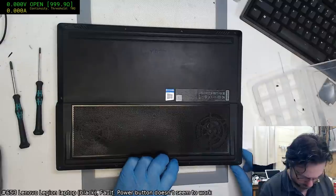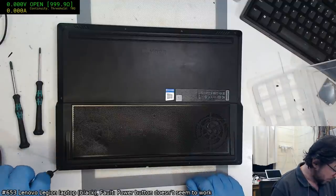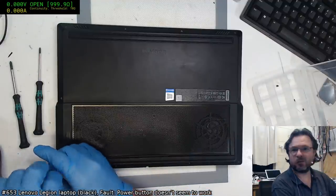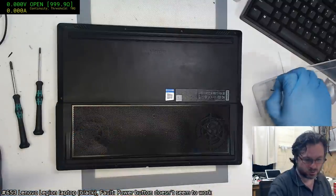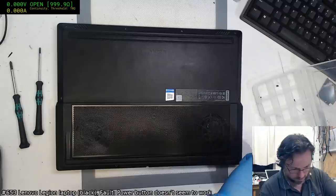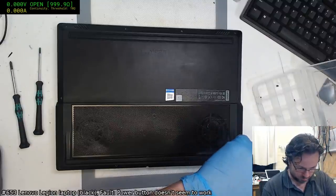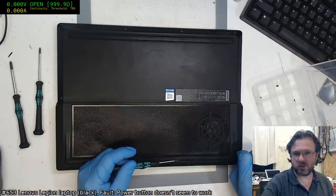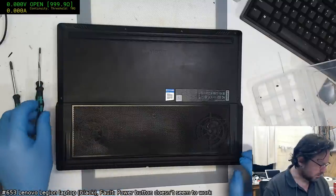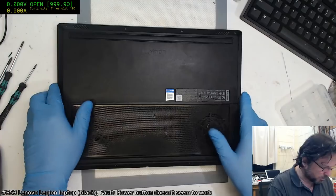Commutix, yes it does. If you can find the board view files, then Flex Board View will display them, assuming of course it's a format that Flex Board View supports. But yes, like FZ files are typically ASUS laptops. There's a lot of laptops that Flexboard View does already have support for. Like if you go to Bad Caps and you download most of the Dell or Toshiba laptops, often you'll get board views that can be read by Flexboard View.